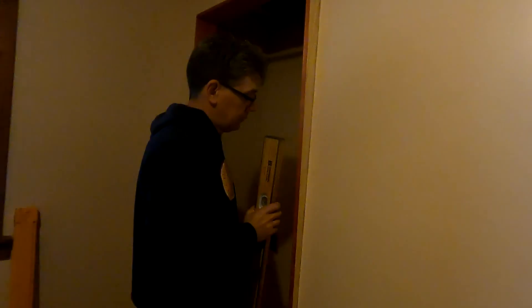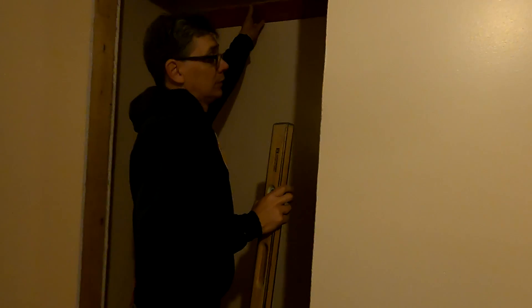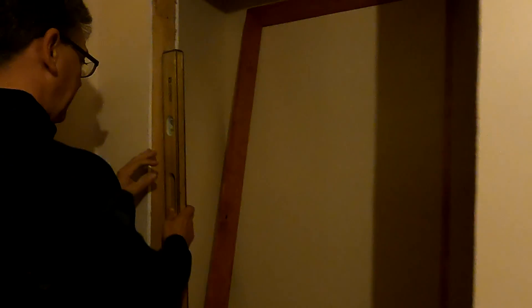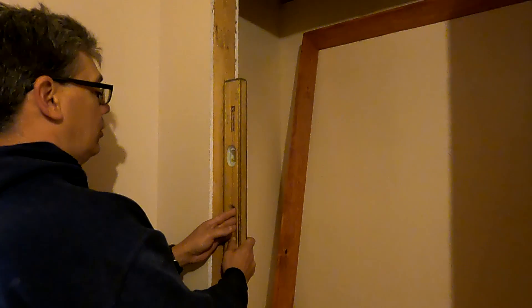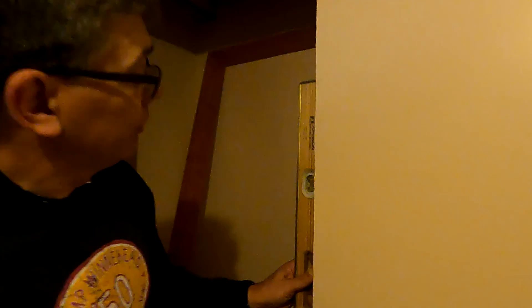And we're back. He's pulled out his four-foot level. I'm just seeing if these are level here. We didn't put these in — these were existing. While we cut the opening, the studs in the wall were here. We added the closet to this room. The previous owner used this room as a laundry room, hence this bedroom will have laundry hookups. They left it a smidge off. I'm holding the bottom out slightly, which is fine. Maybe we aren't tight on the sheetrock. So we'll put a shim up here.